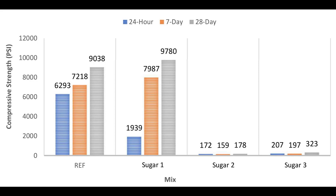With our lowest dosage, at the tail end of the temperature curve we're starting to regain some temperature. Not only do we see that in the 24-hour strength, but also in the seven and 28-day strengths where Sammy and I predicted strength would be skyrocketing. Comparing to the reference, we're 700 psi above the reference at seven days, and at 28 days we're another 700 psi above the reference.